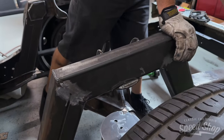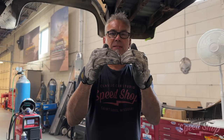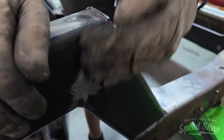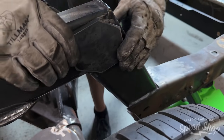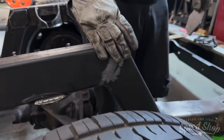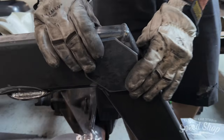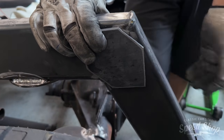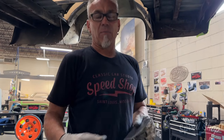These plates I'm putting on — they're called fish plates. Where you weld is a stress spot because it's a seam — you cut a V in both pieces of metal and weld that V up. You grind it flat, then put what they call a fish plate gusset. It welds across that weld area so it can weld all the way around; through vibration or anything that's a potential place where a crack could start. You plate it on both sides — that's why they call it a fish plate. It's like a crutch: putting a broken arm in a crutch that ain't even broken. We're just keeping it from breaking.